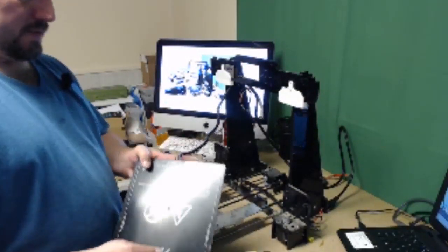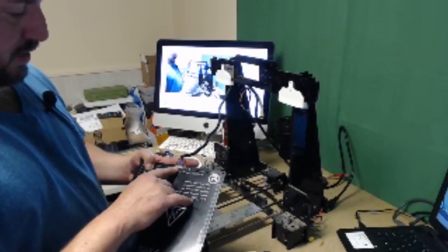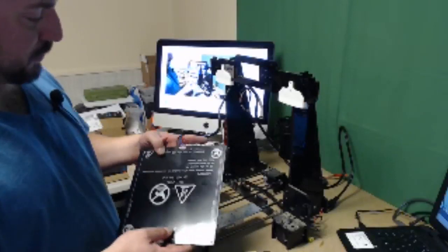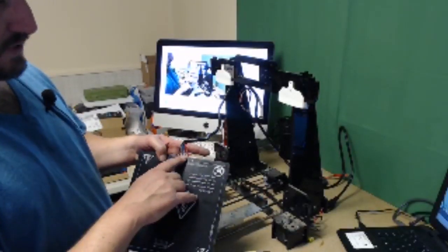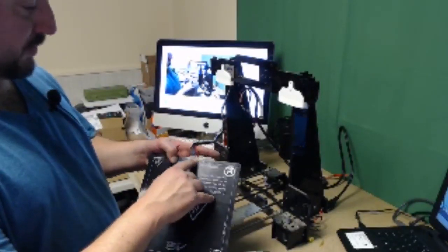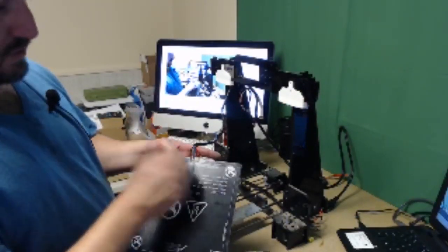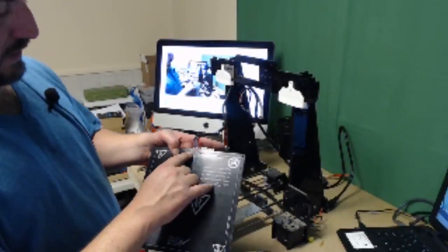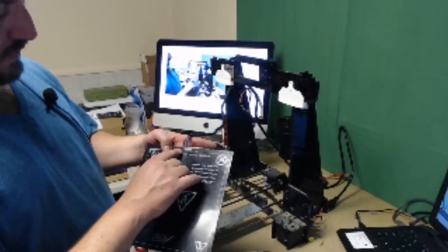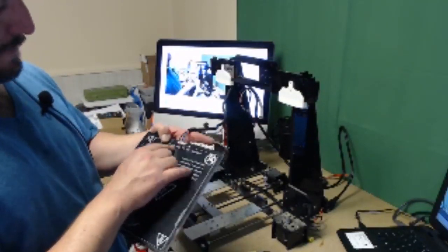Anyway, so this is what I ended up doing on the ANET A8. If you want to see how this is done, you can certainly go on to Joe's channel, 3D Maker Noob. He actually does this on one of his channel streams or videos. I can't remember which. But I desoldered the original coupler that was on here, and just basically heated each pin, removed each one, and then took it off. And then what I did is I very carefully applied heat to each one of these tabs. Just mark which ones you were going to need, by the way. So keep track of that.